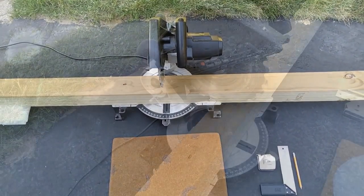Continue applying adhesive, then flip it over and slide it up, making sure the ends of your posts line up. Then put the clamps on and snug those down. You want to let that sit for maybe a couple of days, just to make sure it really sets up good. Then I'll put my new metal strip along the edge there to help reinforce it.